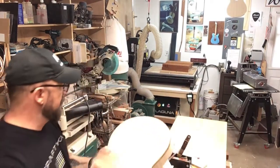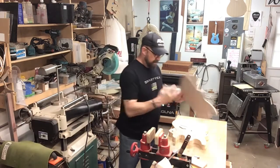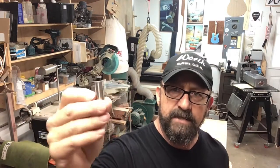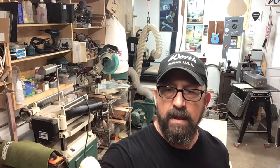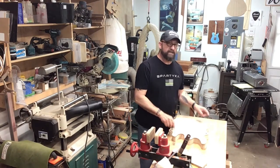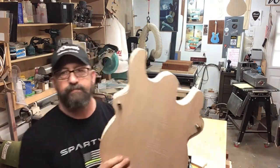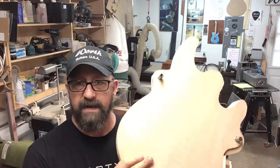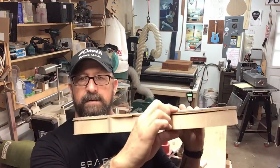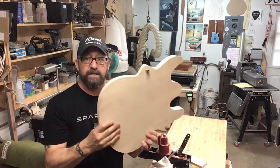And because of the 2 holes that are in there, that I put the same holes that are in the body or in the top, I can use 2 of those 1/2-inch stainless steel pins that I bought. These are machinist pins for setting up machines with. That's their purpose. So when I glue this together, I put these little pins in here. I'll wax them a little bit so the glue can't stick to them. That keeps this top from moving around when I glue it down. There'll be no slipping around. When you put a clamp on something that wants to slip out of the way, it's going to hold it very tight. I can get this top glued down, and then this is ready for the next steps along the line of becoming a guitar.